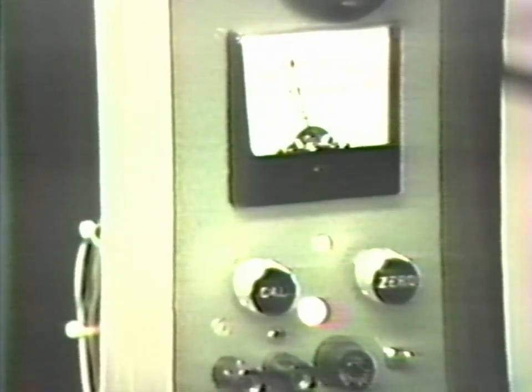Observe the meter reading. If the pointer is not centered, it is necessary to readjust the position of the detector assembly until it is centered. This can be accomplished by loosening the lock screws underneath the center support and adjusting until the meter reads approximately zero.